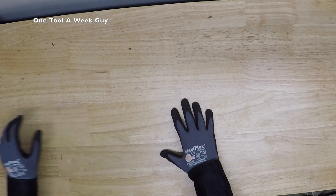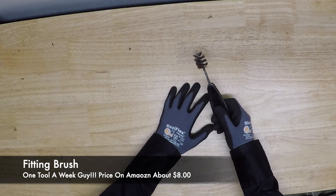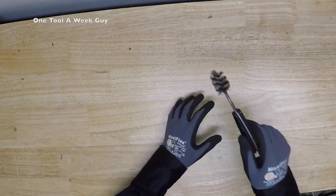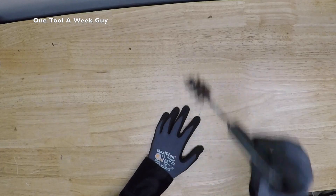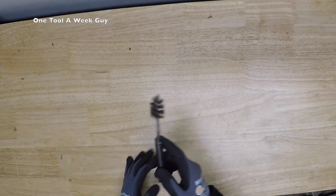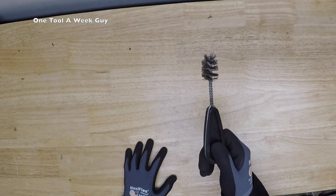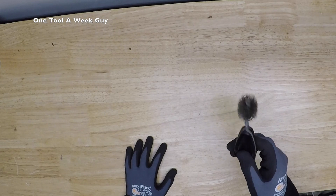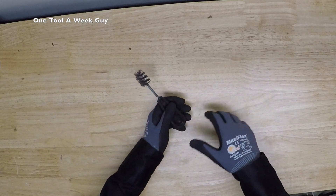When adding filler rod, there are other procedures you'll need unless you're brazing. If you're soldering, you're going to need a fitting brush. It depends on what size you're running - more than likely you'll cut it and connect it to your drill. Brushes are always great to have. The Melrose red-handle ones are pricier but will last a lot longer. So we're adding fitting brushes, and size depends on what you're working with.